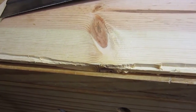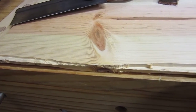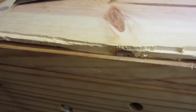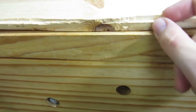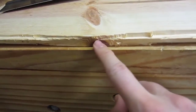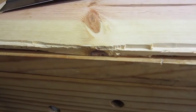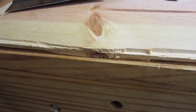I've got a minor problem here. Earlier when I was using my plow plane cutting the tongue, everything was going fine except for this one board. The tongue looks decent here, but then something went wrong — turns out I didn't plan ahead and there's a big knot right here. It was stopping me cold with the plow plane. I plowed as far as I could from both sides, but the tongue is basically non-existent where the knot is, so I've got to fix that somehow.